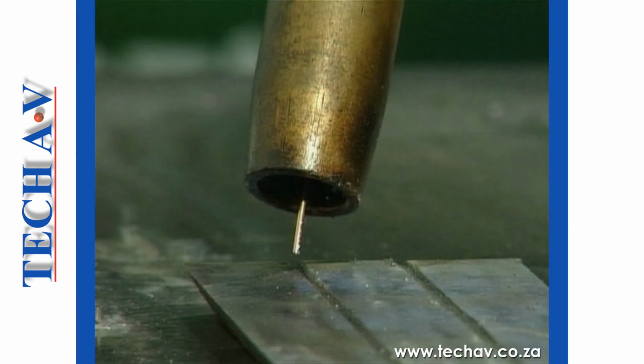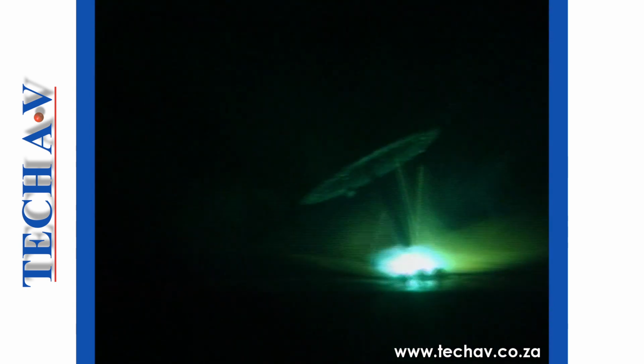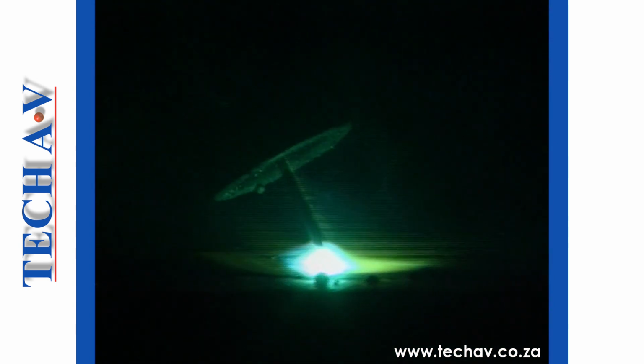A 2 to 3 mm arc gap is required, and when this has been set, the welding hood is dropped and the trigger is pressed. The arc is established and welding begins. The nozzle to work distance must be steadily maintained as you move along the weld line. The speed of travel must be controlled in order to maintain a weld pool of around 8 or 9 millimeters, which is 6 to 7 times the wire diameter.